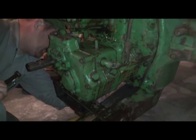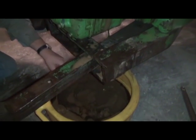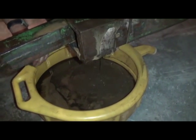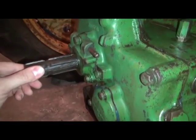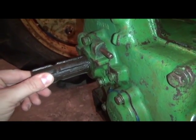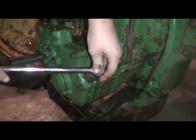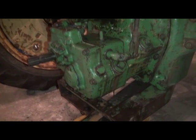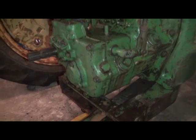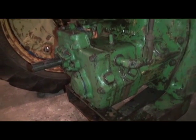Alright, we filled the power shaft clutch housing with kerosene, and we're going to try to dump out some of the remainder of the cappuccino type mixture that we found inside. We also noticed some pretty excessive end play on the shaft. Definitely some bad bearings and a bad seal and some other things, and it looks like this unit's probably going to have to come apart at some point, but for now we're going to try to adjust it. It does engage and disengage and the shaft actually stops, so the brake must be doing something. We're going to go inside for adjustment in just a little bit.